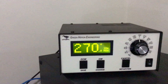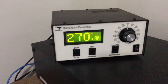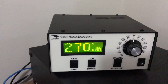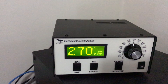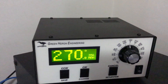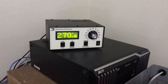You just got to remember that if you've got one of these and you want to put more voltage through it, you need to get in there — there's an option where you change a jumper on the board so it'll accept an outside DC input. Otherwise it's just going to use the 12 volts that you're providing from the power supply, because it hasn't got a transformer in it — it's just a DC version. So there you go. Hope you liked the video. This is VK3AWG, 73s.